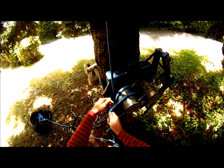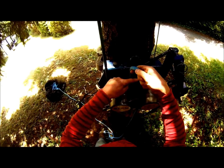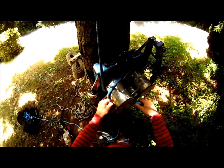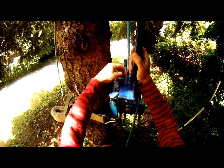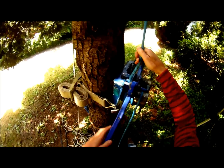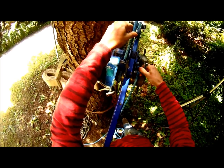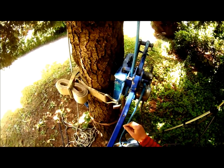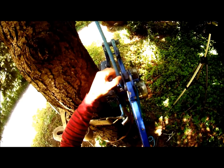To the left side, take a couple of turns — always make sure that the line goes around both of the rear fair leads. Swing over and the line quite easily drops the jaws, then close the gate. See the little gate? Now there's no way this line can come out.